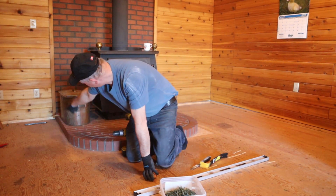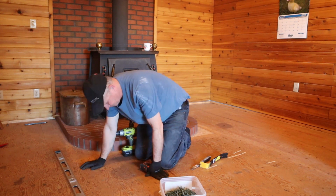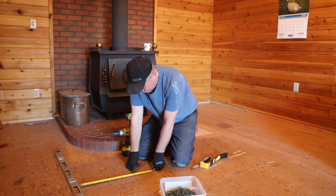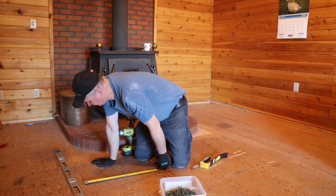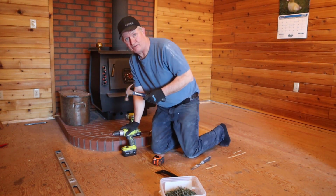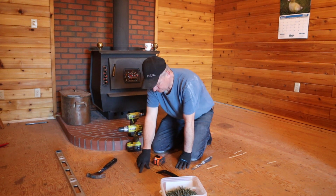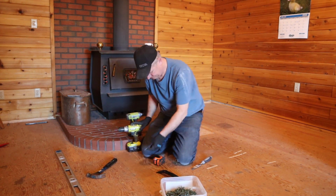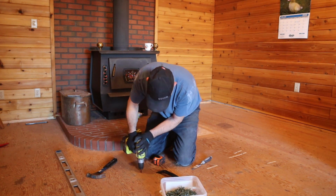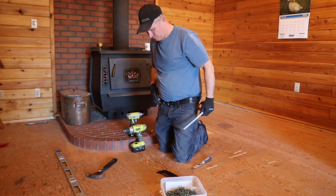And if I look over here, there's a register over there. So somewhere around starting here, the floor joist. So if I go this way, it's 16 that way, so it won't be there. I'm going to try to pound it, see if it works. Grab me a hammer. I'm going to do the pounding trick, see if it helps. Makes a lot of noise anyway. So it should be right here is one. And there is. So if that's the case, then there should be one 16 inches over from there.